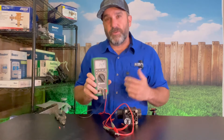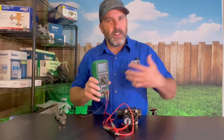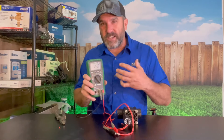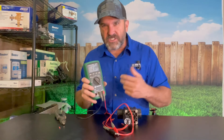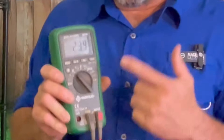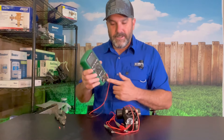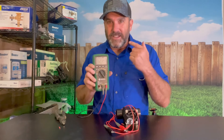The omega symbol is the symbol for ohms, and ohms is testing the resistance of this solenoid. A lot of guys also call this testing continuity — it kind of means the same thing. What you want to see is a good solid resistance number. This is reading 23 ohms, so if you're testing your Hunter valves, this is the number you want to see.